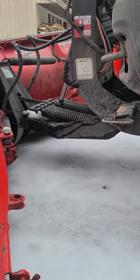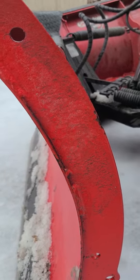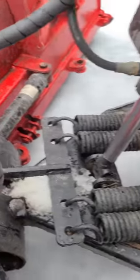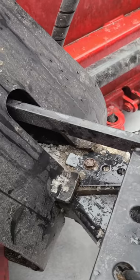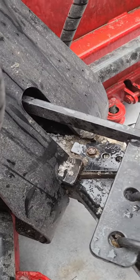As you can see, they recommend that the piece that connects to the plow be level. Mine is slanted downward. At first it was a big problem because the plow was tipped way forward, so only the front part of the V was hitting and it was nose-diving into the ground. I didn't think I was going to have an option besides getting some lowering brackets, which I found on eBay. But it turns out on these plows you can take that bolt out — they say you can slide the rubber piece back and forth in there to adjust the angle.